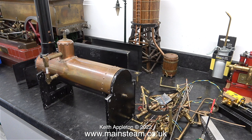There are one or two things I didn't like about this steam plant. For instance, I don't really like the design of the boiler — it's a fire tube boiler heated from underneath with a gas burner directly onto the boiler barrel, and the excess heat travels along the fire tubes. The fire tubes are quite large, so the water capacity of this boiler is very small. Currently the boiler is sat on the cast aluminium end plates — I'll show the boiler in more detail in the next episode. You can also see some of the piping on the bench — it's a piping extravaganza.